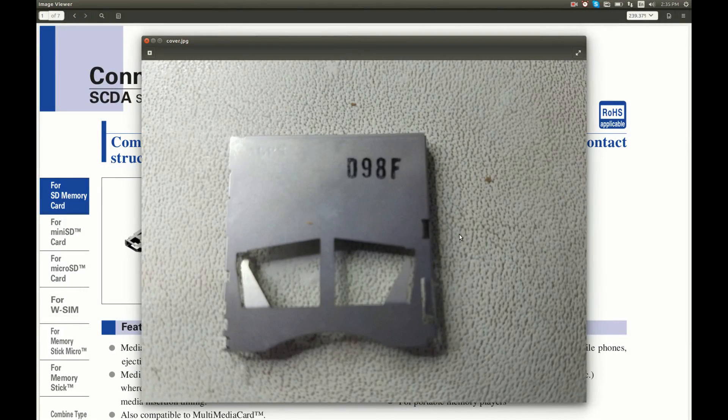I tried to find a replacement for this SD card connector, because I think it might not be very easy to salvage one from that dead R16. It's one thing to desolder and throw away, and quite another thing to desolder without damaging or melting the plastic and then reuse it. So I started looking and there is a faint mark here — ALPS — but this mark was not very useful and did not help me at all. Probably it is a date code or something like that. There are so many ALPS connectors with different pin configurations that I could not find the right one for quite some time.